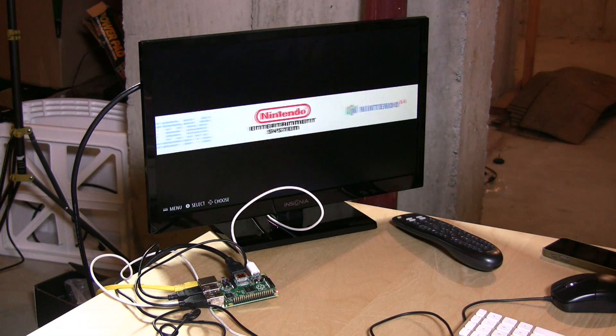I have a wired USB controller plugged in right now, but if you have a Bluetooth dongle you can plug into the USB port and use a wireless controller. It supports PlayStation 3 controllers, Wii controllers — you name it, it'll probably work on here. You can even do some hardware configuration with those GPIO pins and connect Super Nintendo and Nintendo controllers to it as well, and they have specs for designing that hardware yourself.